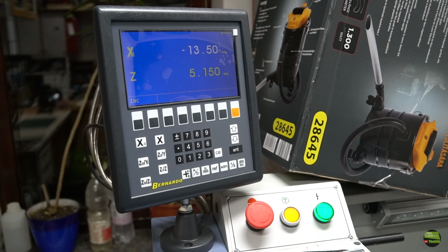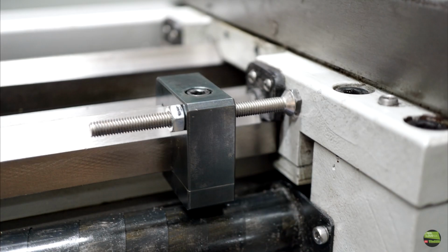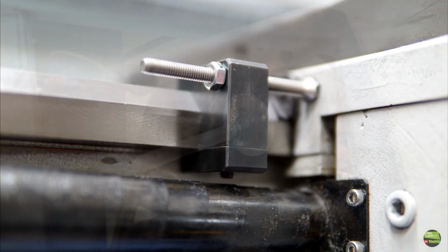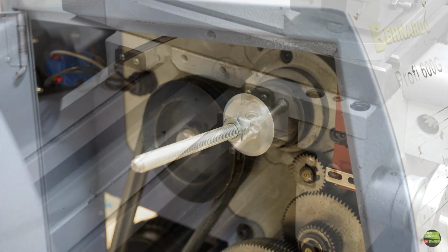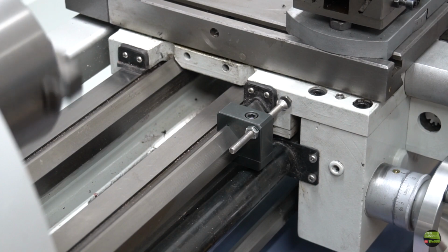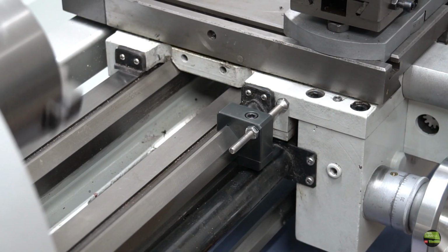That simple but so useful tool took a few hours to make, but can save a lot of time and make some parts serial. But that limiter is quite useless until I get a limiter into the chuck, which I'll make in the next video, and also I need to be careful to use it in manual mode only, because that lathe doesn't have a clutch on the lead screw rod, but I definitely think about making it, so the clutch will slip when the apron reaches the limiter.